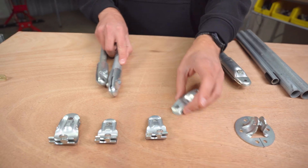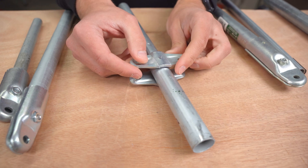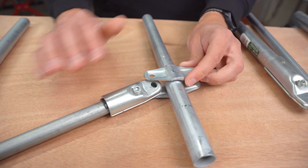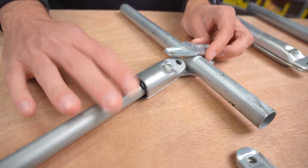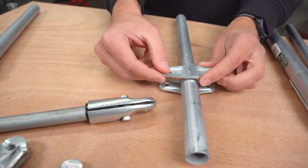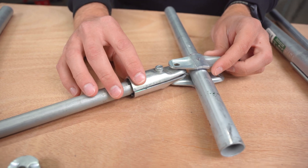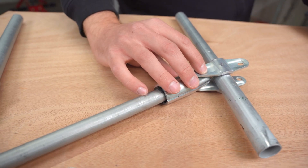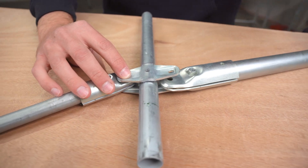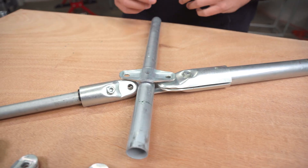For example, with the adjustable 180 — let's say you've got a three quarter inch piece of EMT conduit in the middle of your build and you want to add some half inch EMT conduit bracing. Instead of using three quarter inch, you could save money by going down to the half inch size. This middle clamp is designed so that the gap between the two pieces can accept the end clamp from any of the three sizes. You could even do one inch EMT on one side, three quarter inch in the middle, and half inch on the other side — mixing all three sizes.